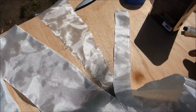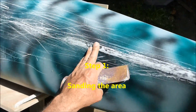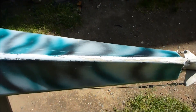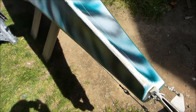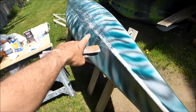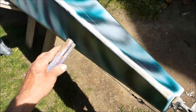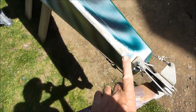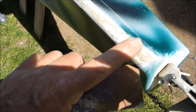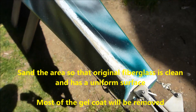Most of the time you'll be working on the outside of the hull because you've got rock damage or more likely drag damage. On my boat, the keel section at the end is laid up with about eight or ten extra layers of eight-ounce cloth, and there's a seam running the whole length of the boat. The entire belly is reinforced with sheets. But here you can see it's broken all the way through into the original material — there was a bit of kevlar fray — we're way down into the base material.